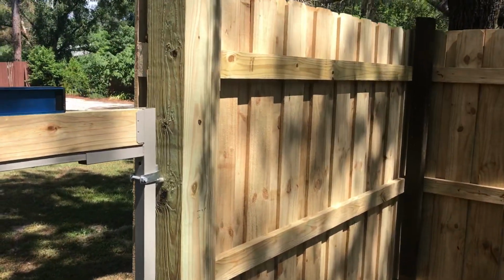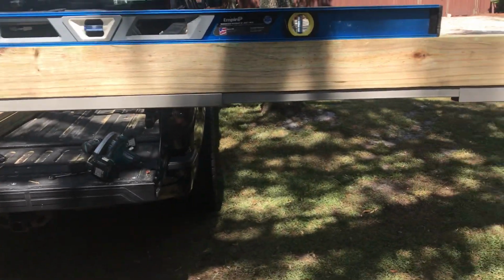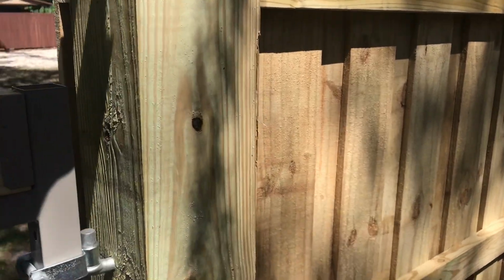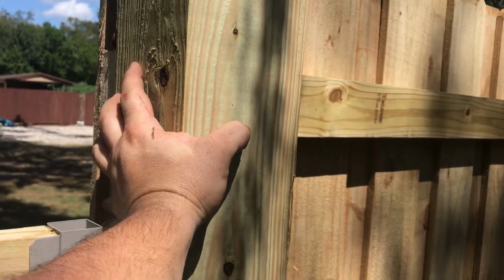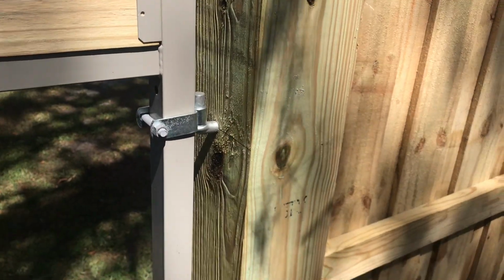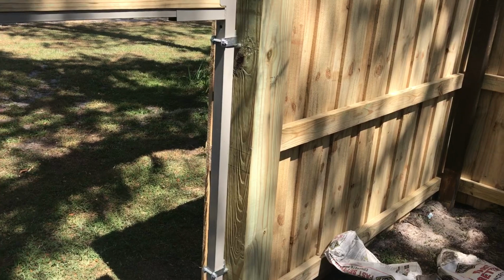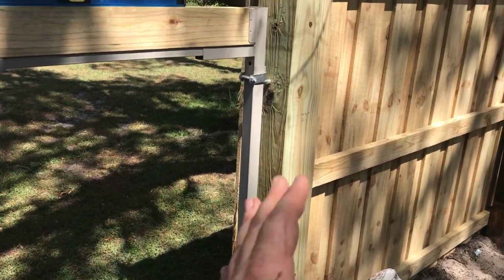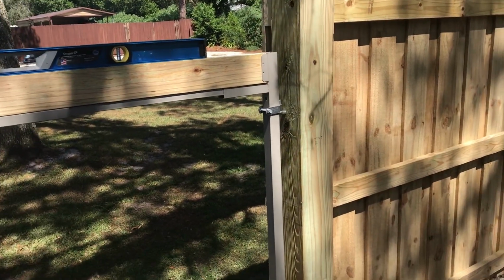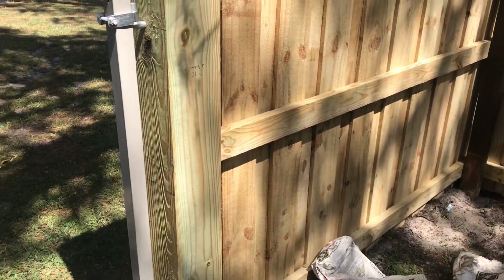When you're doing a gate, I did a video a week or two ago about the same double gate setup, and I changed up my strategy. I put in a big old chunky 6x6 as the gate main post, and I gotta say I have a lot more confidence in this system. Obviously it makes sense that a thicker post gives you less play and more structural rigidity, but I wasn't expecting this result.